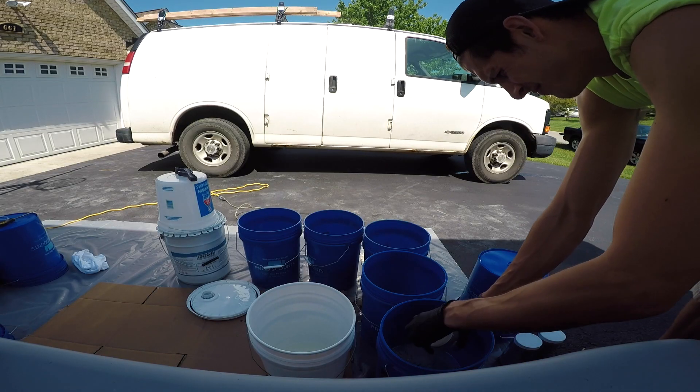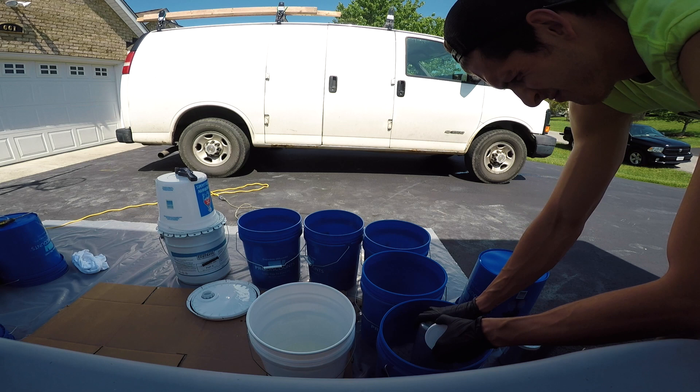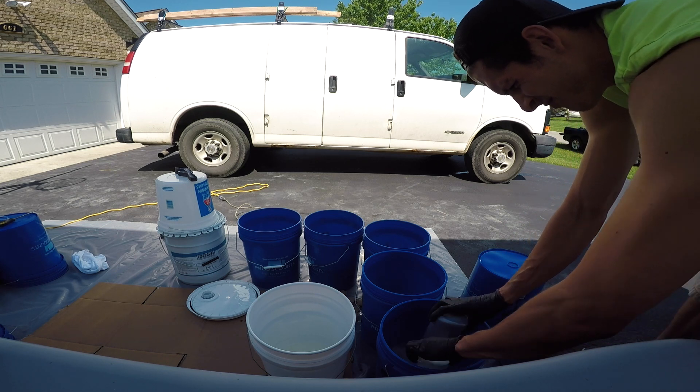We actually had to mix all of our metallic powder before we even started the job. In the clip I'm about to show you, we're doing a 1,200 square foot garage — I knew it was going to take five or six batches of epoxy. So Daryl would measure six batches ahead of time, dump metallic powder, then blend the powder in each batch before we started the job, so there would be no lag between mixes when we're actually pouring the floor. I went through some old footage and found a clip of him pre-blending metallic powder one day. It was like 80 degrees — super hot — and he was out there struggling. I set a GoPro up and recorded it, so I'm going to time-lapse that footage of him mixing the powder. Hold on.